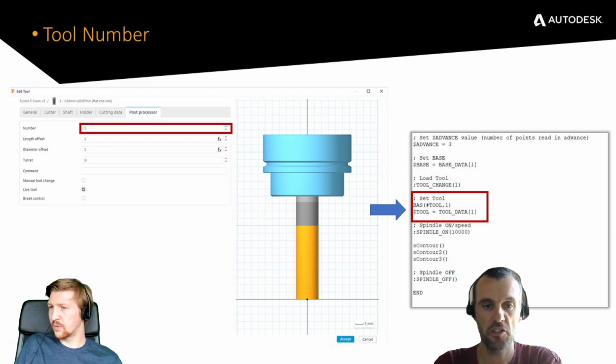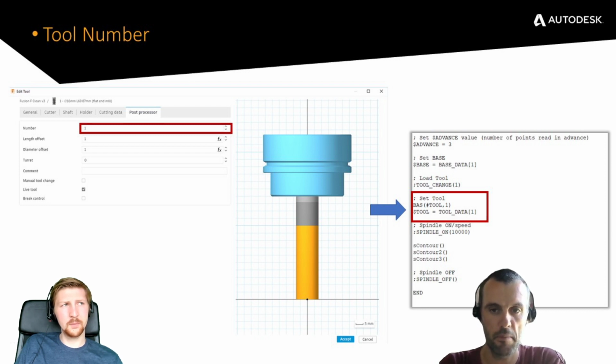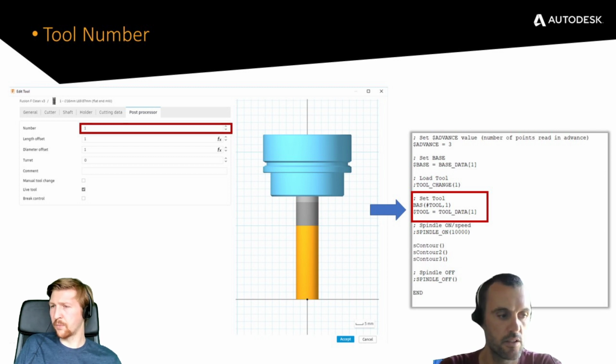Yep. So I'd say this is like 90% of my job, is defining a tool correctly, defining a coordinate system on the part, on the machine. Having the knowledge like we just showed now to confirm and define these, and then making sure that when you post-process everything matches, that's like 90% of the work done. These are all the errors that you might get. So I think this is why we chose this format, and hopefully to empower people and share a bit of knowledge, and people start milling with robots.